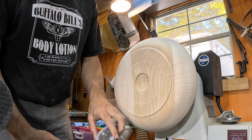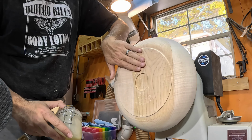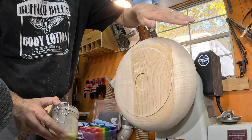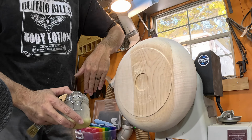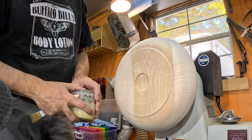All right, so for those of you who have watched my channel for a long time, you know that I don't put a lot of recesses in pieces, but because I'm going to use the Tung wax finish from Brad's, that's a little harder to put on without being on the lathe. It can be done, but then you got a little extra hand buffing. So I had to sand it up to 240 grit, hit it with denatured alcohol.